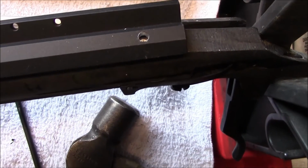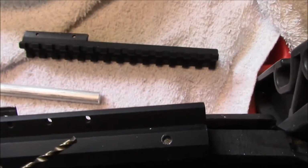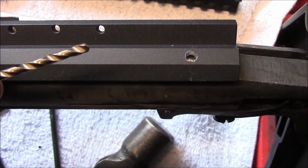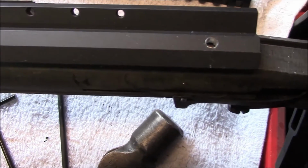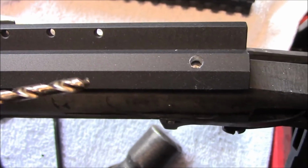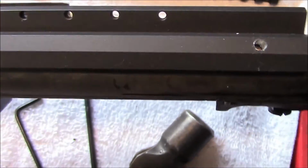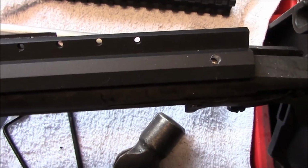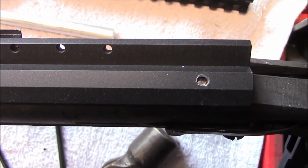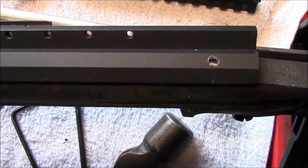I'm going to drill this with a cordless drill using a cobalt split tip 1/8 inch drill bit first, followed by a .156, that's 5/32. The tap drill chart shows .159, this is .156, it's a little smaller. All that's going to do is give you a little bit better thread depth, and since you're using a cordless, it's probably going to come out to around .159 anyway.